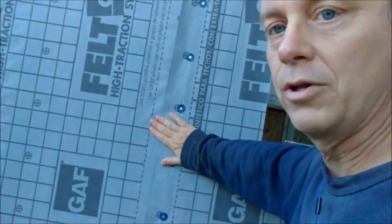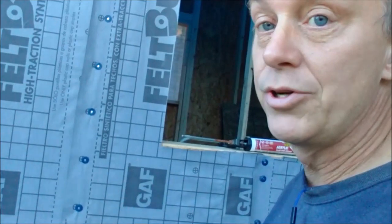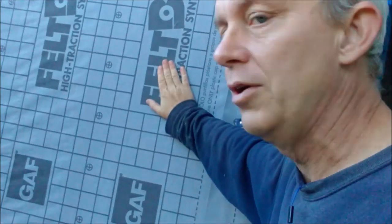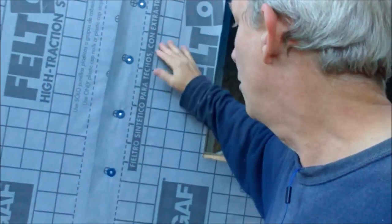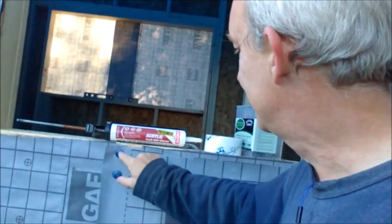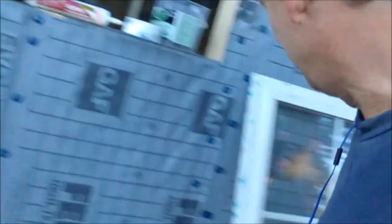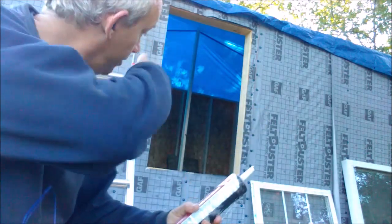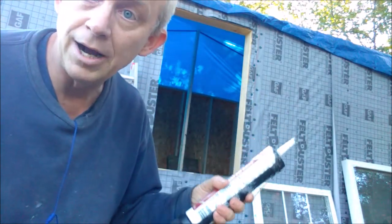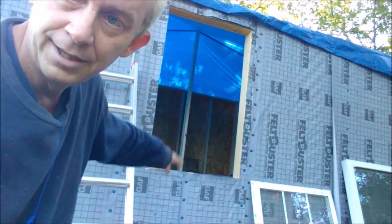A lot of people are disappointed that I went vertically with the house wrap instead of horizontally, but Google clearly shows you can do either on walls. If you go vertical you give a foot to six inches of overlap; horizontally you give six inches — so it doesn't really matter either way. I'm going to tape it for extra security. And I noticed I put a nail where the window goes, so I'm taking that out. First I'm going to seal around the window opening so when I press the new construction window up against it, it'll seal nice and tight.